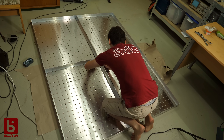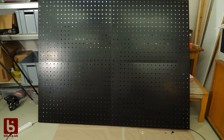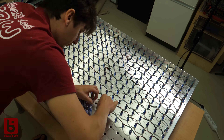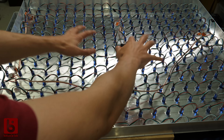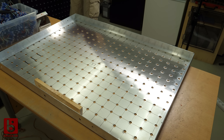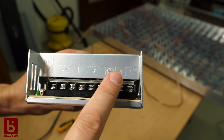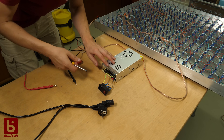The four panels are connected by several 6mm bolts. That's huge! The LEDs are the same as last time — six sets of WS2811, each panel in series. The 5V from the power supply is wired using some thick speaker cables, and distributed to the extra ground and 5V ends at each connector. To be able to interconnect the panels I also had to extend the connectors a bit. The power supply is connected directly to mains and provides 5V and ground connections to handle the 70A. There is also a trimmer to adjust the voltage — I was a bit worried it might explode on me but it worked really well.